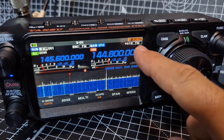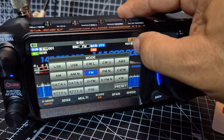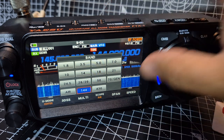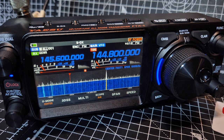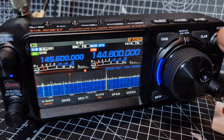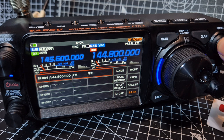And to store that in memory — we're in FM, look. You can just tap the screen for FM. And you hold down the button to select 2 meters as well, if you don't want to type the frequency. Then to store that into memory, you literally just press and hold VM. You don't need any shift, minus or plus, or CTCSS — you don't need anything like that. Press and hold, then turn to a blank channel with your function knob.